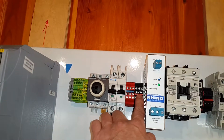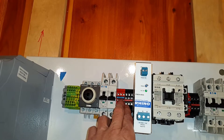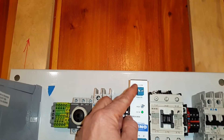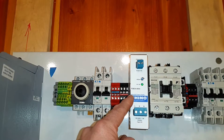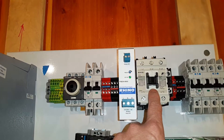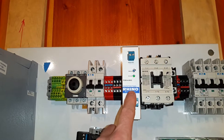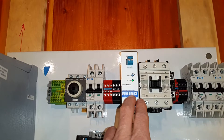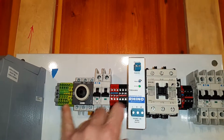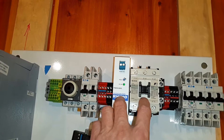After we come out of the circuit breaker, this is our AC bus — post circuit breaker AC bus — and power goes from here straight to this DC power supply. This is a 24-volt DC supply: 240-volt AC comes in and 24 volts comes out, about a 60-watt supply. Its only purpose is to drive the latching circuit for the contactor, and this 24-volt DC goes through the e-stop switches. I didn't want line voltage going through e-stops, because at 240 volts you're going to get whacked.